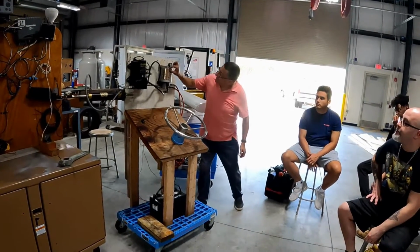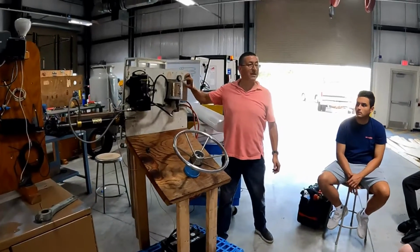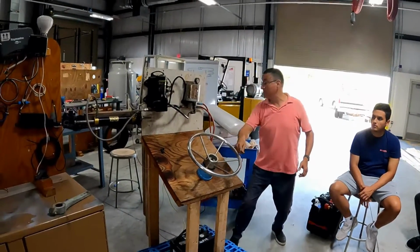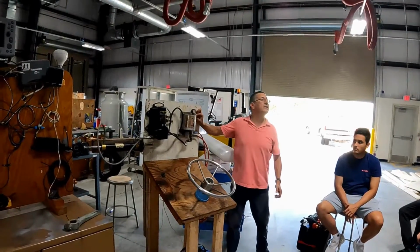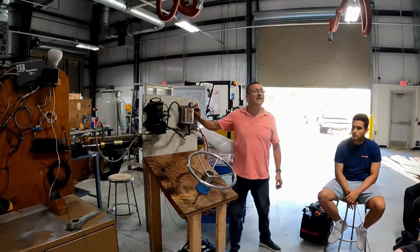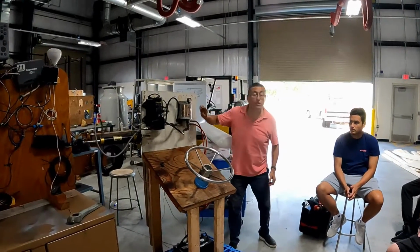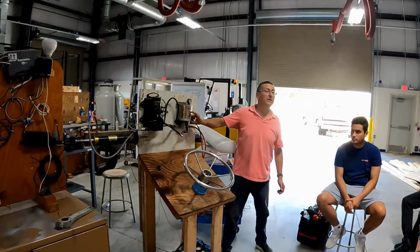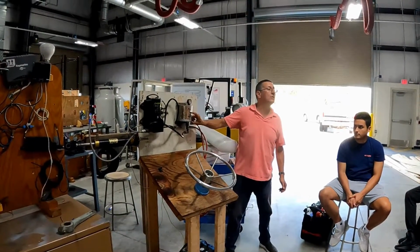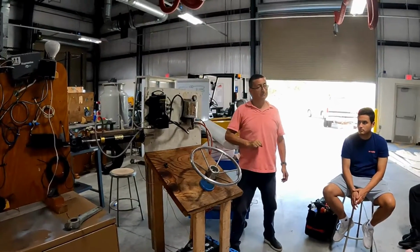Look, this area, this compartment is air. Each time the fluid passes from the pump, through the lines, and enters here, the air goes up and is accumulated here. It's almost like an expansion tank. And for that reason they say maximum oil until this point, until the middle of the second window, because you need that space for air.